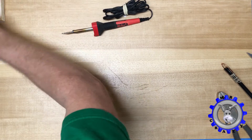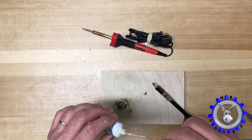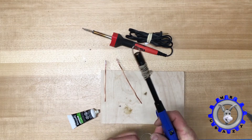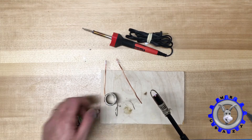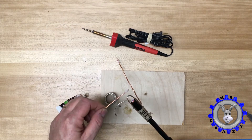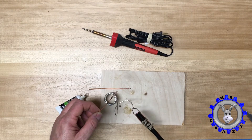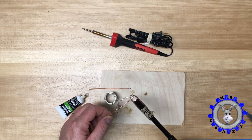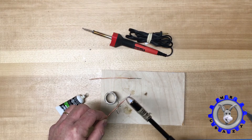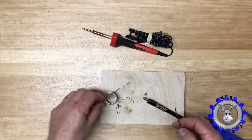Let's try how it works — we'll do the same procedure as with a real soldering iron. You need to apply the flux first on the wire, and of course on the other piece too. Then we need to heat it up a little bit. On both parts we now have flux on the wire, so let's try putting them together.